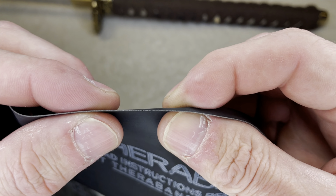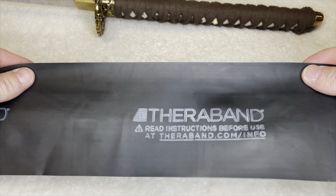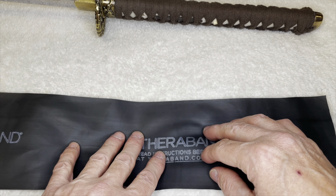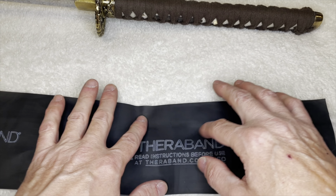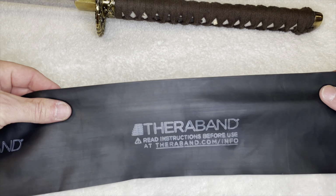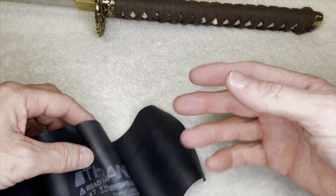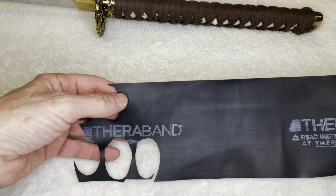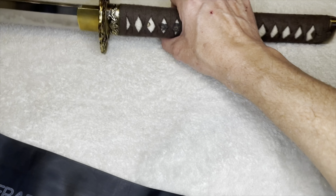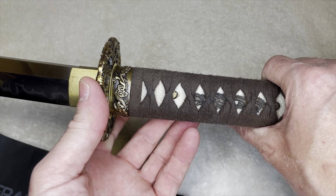I wanted something that's thin. It's like construction paper thin. And I thought about using maybe bicycle tire rubber, from the tube of an inflatable tire, and just cutting a tsuba-sized rubber grommet, a washer if you will, and cut that out. But I decided to use this because it was a little bit thinner, and I could always put two if I need to, or three even. And it's rubber, so it'll smash. And I got this idea from Joe of Steel Forged in Fire, who changed his name. It's JS Bladecraft, I do believe, now.